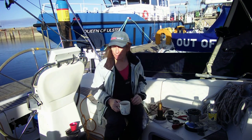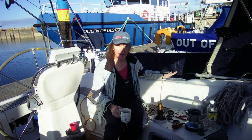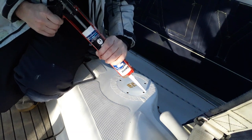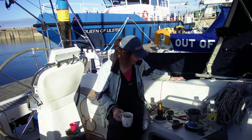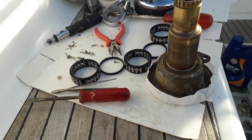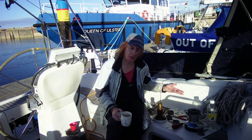Okay, it's coffee break time. I've got everything off. I have got this area here masked off because I will be putting silicon sealant on it — and I repeat that, silicon sealant. I will not be using Sikaflex or Marineflex or anything that's adhesive, because if I do I will never ever get this off again. This is going back on silicon sealant to keep the water and weather out, but I do want to be able to service this again in the future. The other items I've kept together in the order in which they came off — top section, inside section — first, second, third, fourth, fifth. That's the sequence they came off in, and that's the sequence they go back on, or rather the reverse.